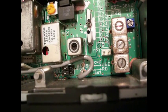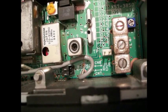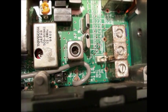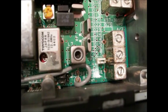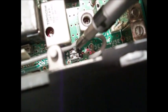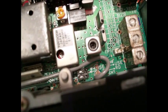Now I'll let the camera focus there. As you can see, the CN8 letters, and you have two arrows. To the right it says 'use,' and to the left it says 'set.' There's three little wires sticking out and there's a little jumper, and you're going to put that jumper on one of these two. If you want to change your frequencies or just program it from the front panel, you're going to want to have this pin on the left. Grab some tweezers or needle nose pliers and put that on your two left pins if it's not already done for you. That's going to put your radio in the set mode.